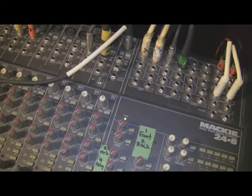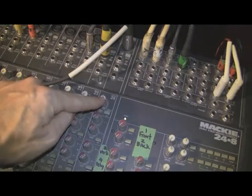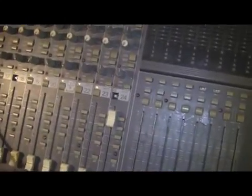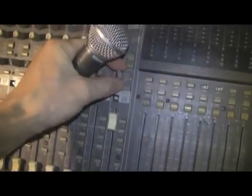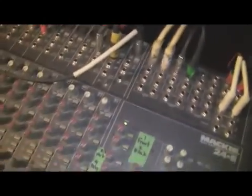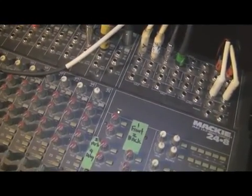And at some point, I'm going to hear the potential for feedback. Chop, chop, chop. I heard it. So the gain control is at the 12 o'clock position. I'm going to pan the signal to the left so I can do the left side first. And then I'm going to adjust the EQ and try to figure out what frequencies are feeding back.